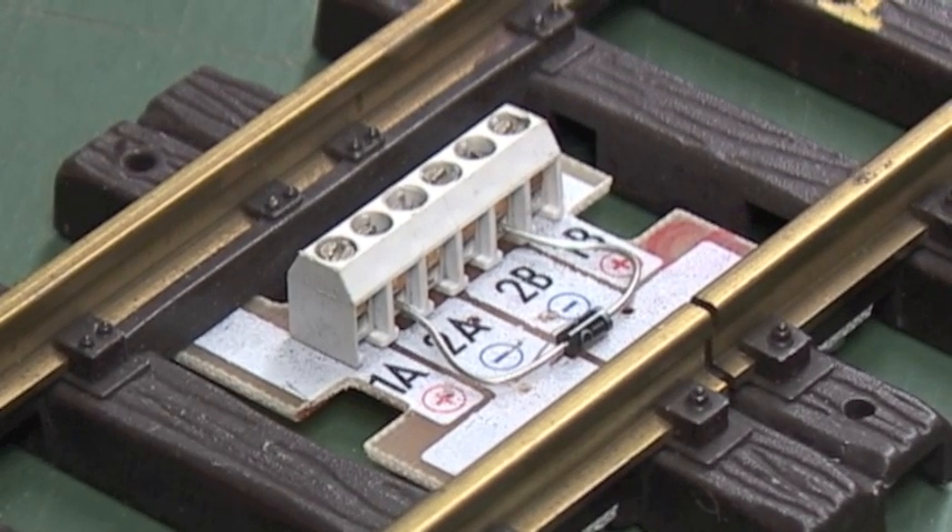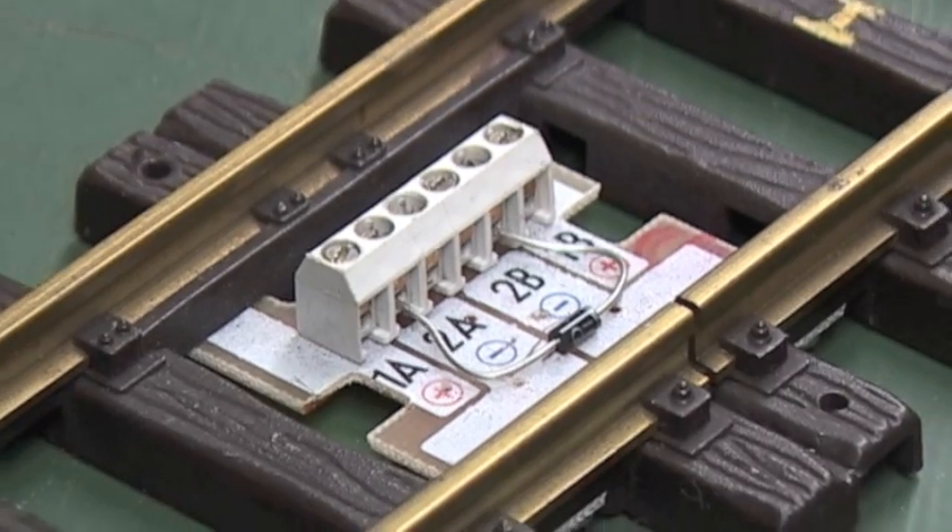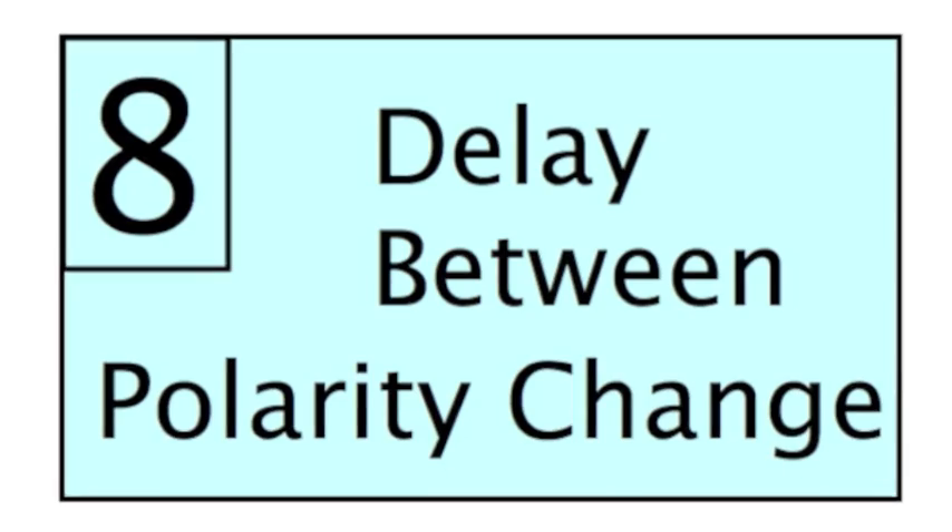You can see on this large scale one the gap is on the same side, but the gray band on the diode is on the far end — away from the camera — so it's actually reversed. That's because on large scale the left rail is positive in the direction of travel, which is different from all the smaller gauges where the right rail is positive. This is one of those LGB gap tracks where the factory provided the gap in the terminal block, making it easy to wire the diode in using screw terminals. If you get it wrong, it's easy to flip it to the correct direction without unsoldering anything.